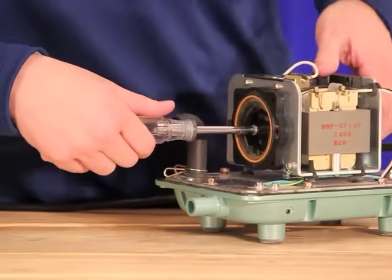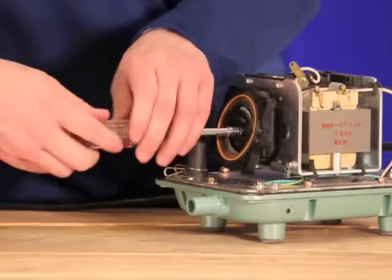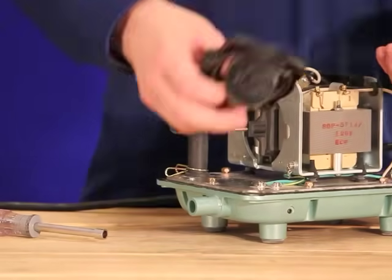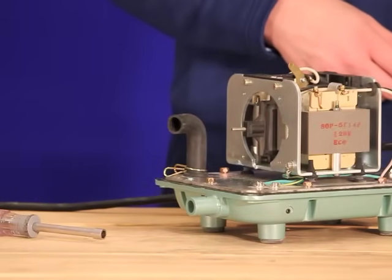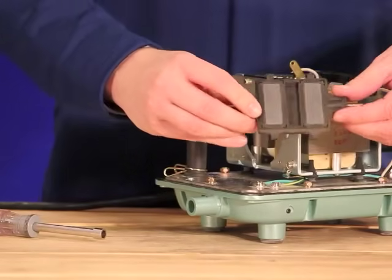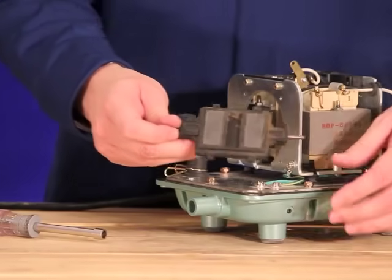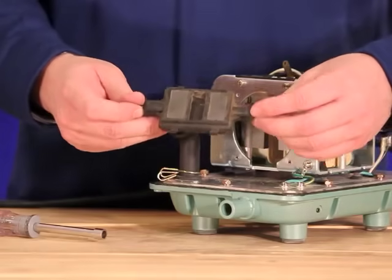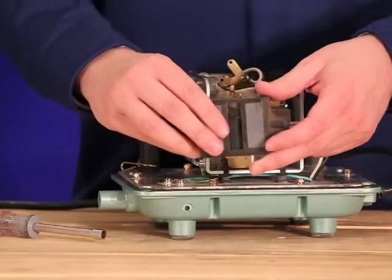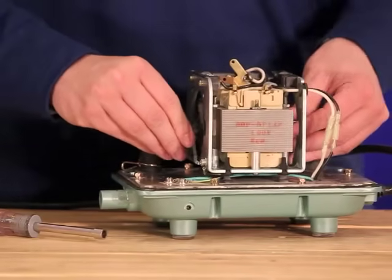Again the 7mm nut — you can push that rod over to this side if you have to, to make it easier. Get the 7mm nut off, and another busted diaphragm off. Now the old parts are taken off. You can pull this rod out and you will want to look at it. This is what we call a magnetic rod block that is attached to the diaphragm — it is the only part that moves, vibrating back and forth in the pump. You will want to check to make sure it is not cracked or broken in any way, because if it is and you put new diaphragms in, the diaphragms will fail again. Also, it is highly magnetic, so make sure you don't have anything that a magnet could damage near it.